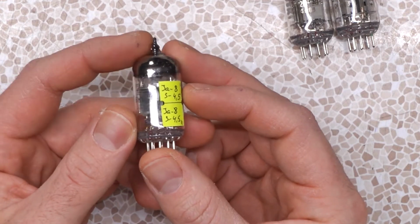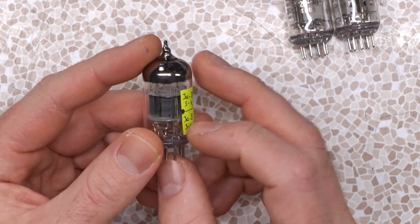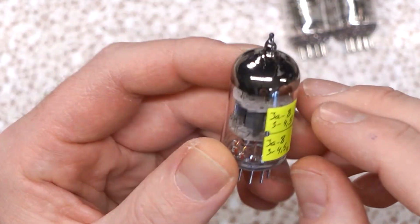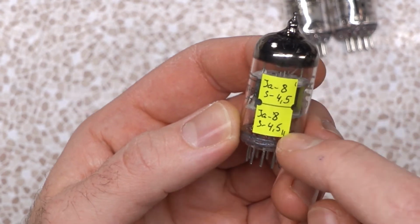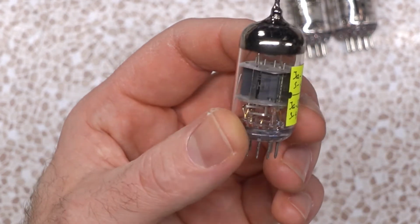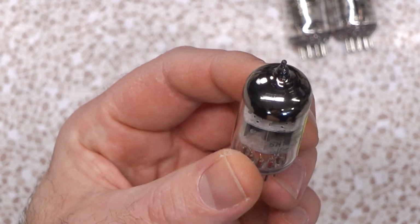Now, there is a little bit more. Another very similar tube is the 6N1P, also EV rated. Oh, this guy says 1977 on it. Apparently this has matched sections, so that's excellent for a phase inverter, theoretically, or audiophile use. Bit more than you need to worry about for a guitar amp. You don't need matched preamp tubes for guitar amps. In fact, some will say mismatches enhance the sweetness of the tone, because that's where certain harmonic distortions get brought out.